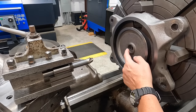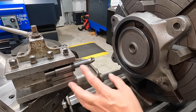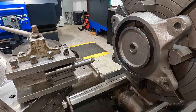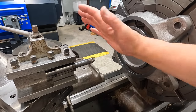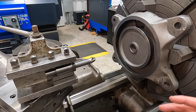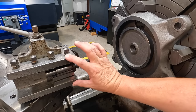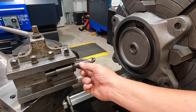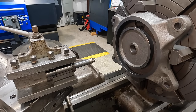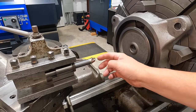That's nice. Okay, I got us a bar set up. We're gonna go in here and finish out this bore. So this is the D1 size multi-fix that I use, the Pee Wee tools. And whenever you're dealing with these larger tool holders like that and having to get things reduced down to these smaller tools, it can sometimes be a little challenge finding the things you need. I haven't used this size post enough to have everything that I need readily available to just quickly grab a tool and throw it in here and go with it. But this little system for this bar right here, this holder worked good with the V-block, split bushing, and then we got a nice three-quarter shank boring bar there. This is a carbide shank that should work pretty good with, I believe that was a CCMT. No, I'm sorry, that's a triangular tip. I can't remember what that one's called.